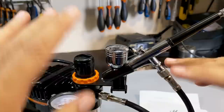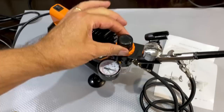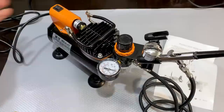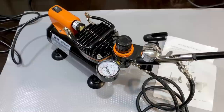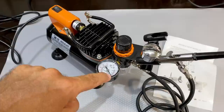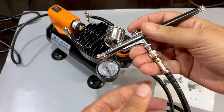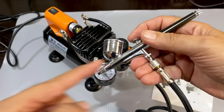I've never worked one of these but it's incredibly simple. I've got it plugged in and haven't adjusted anything. This knob comes up and down — you pull it up to adjust and push it down to lock. I switch it on and it's already hit four bar. Four bar, if you want to know, is about 58 PSI. When you push the trigger down, air comes out. When you push it down and pull it back, paint or whatever liquid you have in the cup comes through.